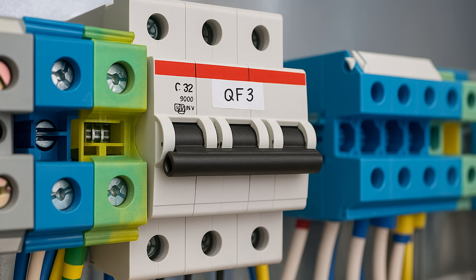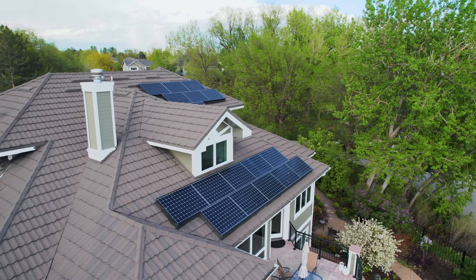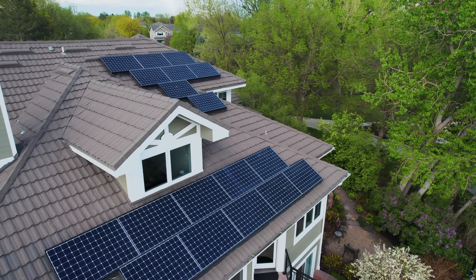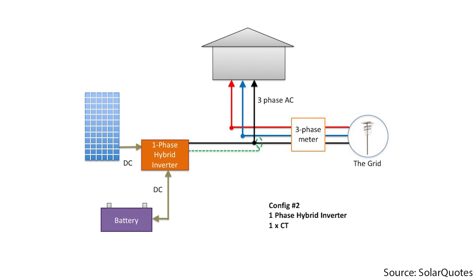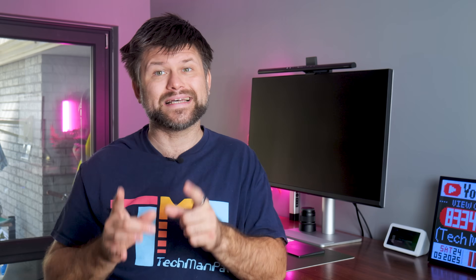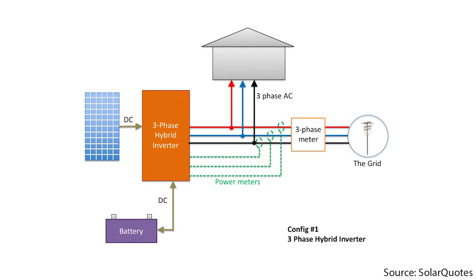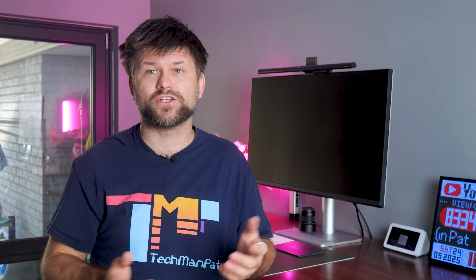For those with three-phase homes, you're essentially receiving three active wires delivering power to your home, allowing heavier loads to be distributed. So if your home is three phase, you have to plan a bit differently. A single battery inverter can typically only connect to one of the three phases, meaning it'll only supply power to that one phase — so in a grid outage only that phase and its circuits get backup power. This is critical and your installer should catch this early, but it does mean a more expensive inverter and battery potentially. For optimal performance you'll need a three-phase battery and inverter that can supply all phases at once. The main takeaway: if you have a three-phase home, discuss it with your installer and make sure your battery solution covers all phases and backs up your most important circuits.